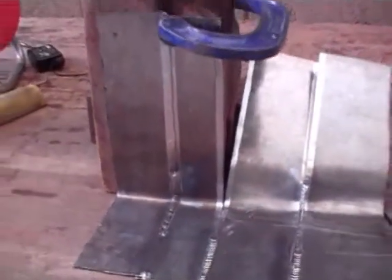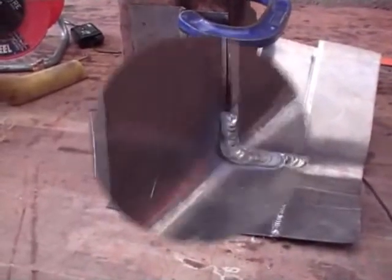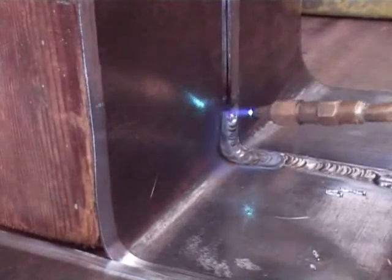Now you have cleaned it again with a bit of hemp, and you can see the weld more clearly. You can see it is proud — yes, that means we have got no undercut. Now it is not extremely pretty like the butt weld because I do not do this for a living. But with a couple of hours of practice I could get it looking as nice as that. You can still get a job done — that is a perfectly acceptable weld.